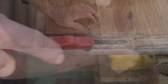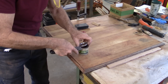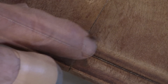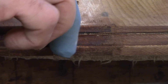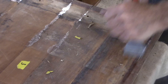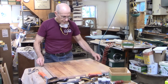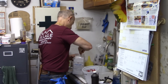This end grain is going to be the toughest part to sand. Finally, I've sanded the edges and scraped the top. There are some dark stains here, so I'm going to treat this with oxalic acid. I don't really measure it out too carefully — I'm going to give a few good scoops to maybe a quart of hot water.